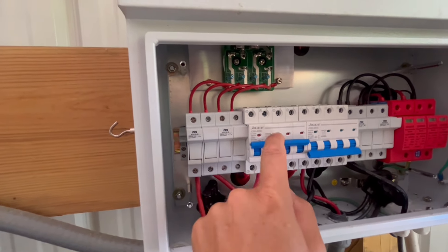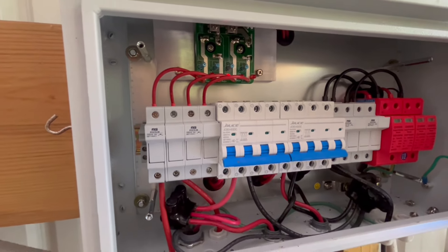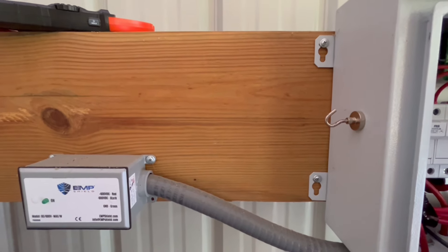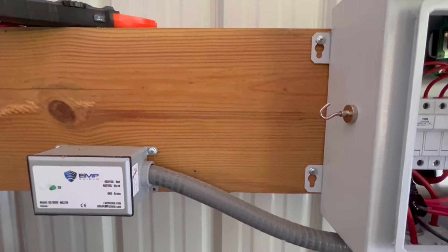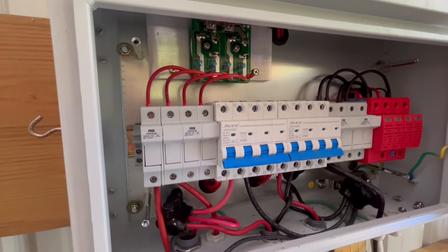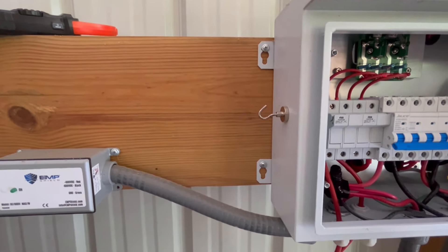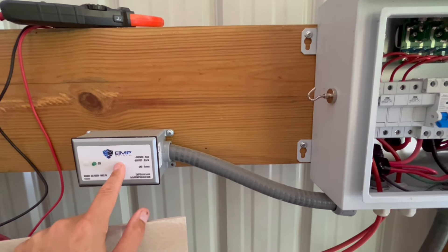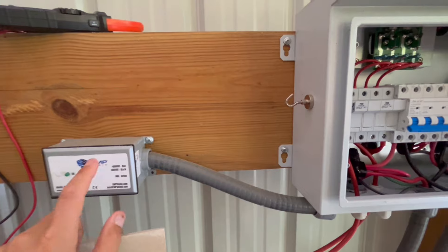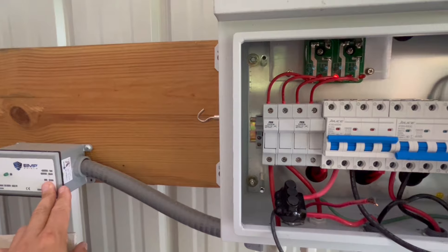The indicator light came on — so that's what's happening. The EMP shield protected my system from lightning, and right now it's just permanently shunting to ground. It's toast, and it's not letting any of my PV pass to the inverter. Even though the inverter still did take a punch — I think it's through the AC side. EMP shield will swap these out in the event of a lightning strike and something like this happens — I think it's 50 bucks. I am so thankful this thing took the brunt of the electricity from the lightning strike.